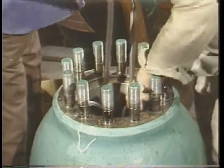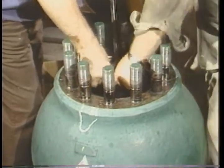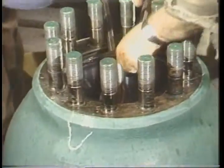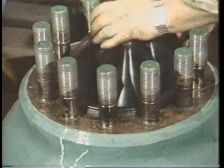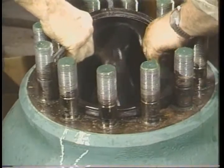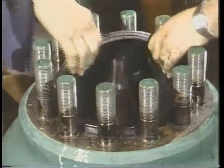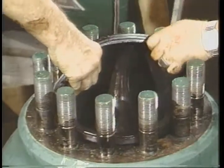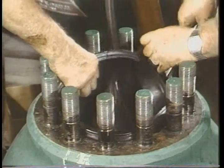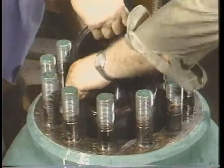The Continental EMSCO diaphragm is a bit harder. Since it conforms to the body and is made of pretty thick rubber, it'll be hard to get out through the neck. To remove it, push down on the side of the neck. Slide a crowbar behind it and try to pry it out. This can ruin a good diaphragm, so make sure you really need to change it before taking it out. In cold climates, you may have to cut the diaphragm to get it out.